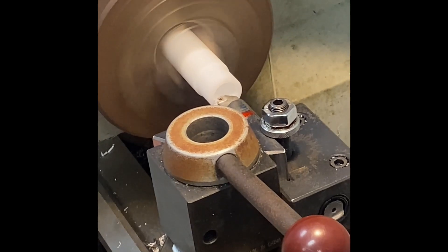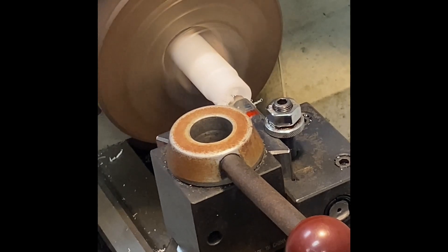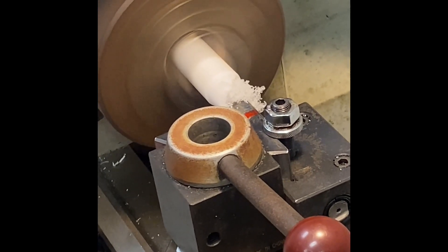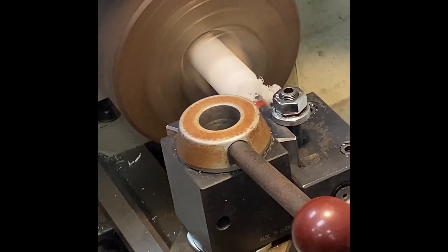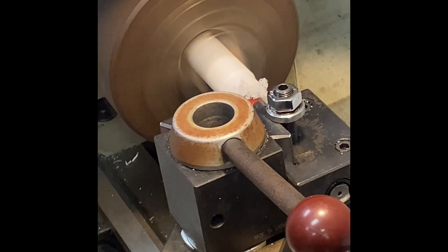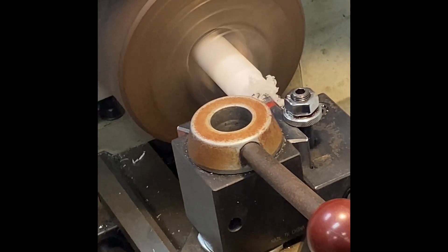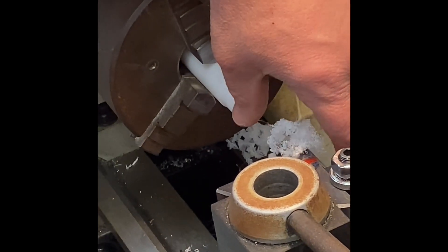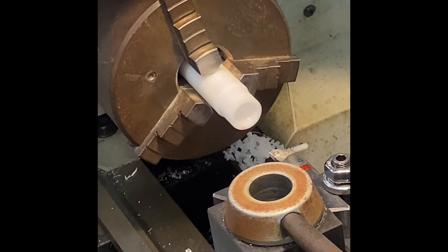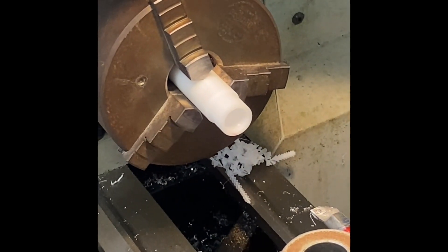Now I can start to turn. The other problem with boring a hole is that oftentimes we can't get the chip to come out, so you need to be aware of that as we go. I'm getting close to depth here, so I'm going to stop, move back to the middle, and extract the boring bar. You can see we were getting kind of a stringer and how that packed up on the boring bar — not really a big deal with plastic, but if we were cutting metal we'd certainly want that chip to break.